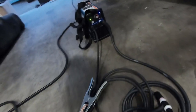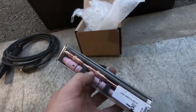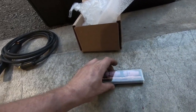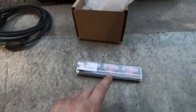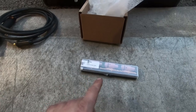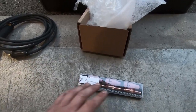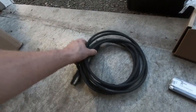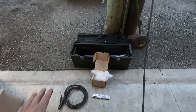The ground is high quality, that's for sure. It also comes with some other cup sizes for the TIG torch, and I think a 1/16th to go with the 3/32nd tungsten holder that's in it. I actually have to look through it to see what tungsten's in there — hopefully it's 2% thoriated. It also comes with a whip so you can stick weld if you want. It comes in a nice carrying case with everything you need. The 240 plug is definitely a nice option if you need everything to get started.